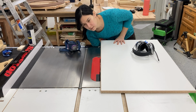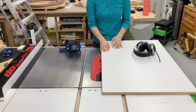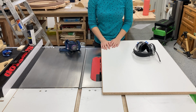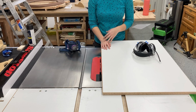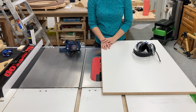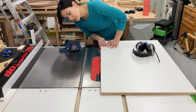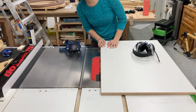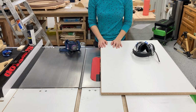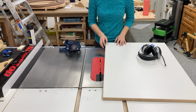The main thing is that you want the grooves deep enough that the vinyl bag can't sink into the grooves and close those air channels. And additionally, if any beads of glue get into the grooves, they also won't obstruct the air channels. So I think 1/4 inch is a good amount. It's 1/3 of the thickness, so it's not going to compromise the strength of the melamine, but it also is nice and deep.